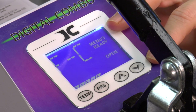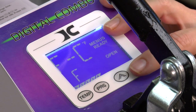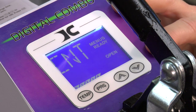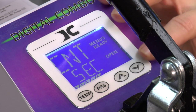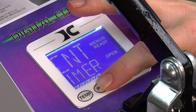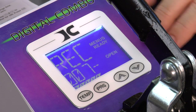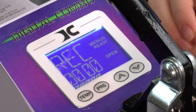If I wanted to change it, I would just arrow up or down and that would change it. We're going to keep it at Fahrenheit. Press program to go to the next screen — what we see here is a counter, which shows seconds. Some people use hours with the press and some people use seconds. We're going to keep it at seconds. Press program to advance — this is a record, basically a recording of how many presses you have done with this particular press. You can zero out this counter by pressing your up and down arrow keys simultaneously. It lets you know how many presses you've made, which is a great feature.